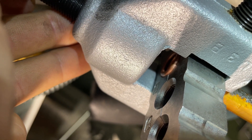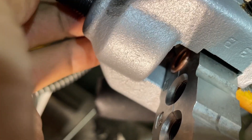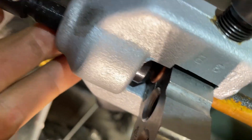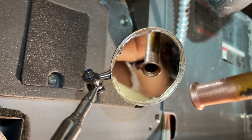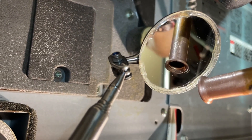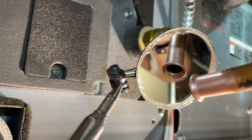The die has finished making the bubble now. We got the die out of there and I'm just driving that little spindle in there finger tight, then tighten it up with the handle and that will finish the flare. There's the completed double flare — you can see how that lip has been folded over; hence the outside of the pipe is your sealing surface.